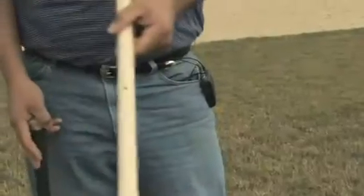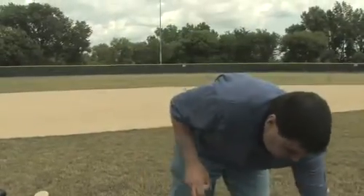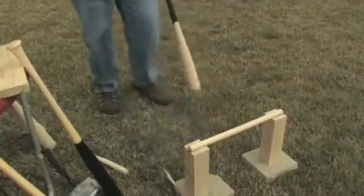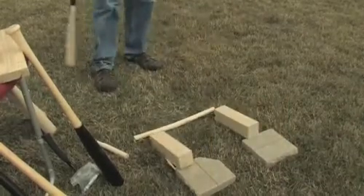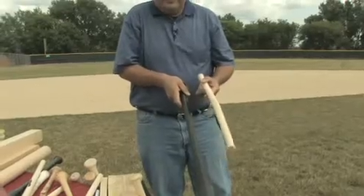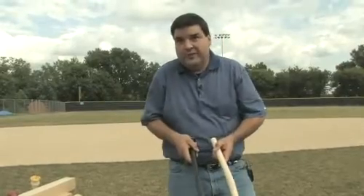The piece of wood that is supposed to be straight grain — we're going to do the same test. As I mentioned, this should be a rupture failure. It didn't take me very much to break the other one, but if I really hit on this one, that is a rupture failure. The rupture failure I showed you there is analogous to the rupture failure that you have in a baseball bat. That is the difference in performance between straight grain wood and slope of grain wood.